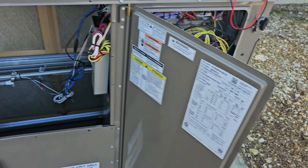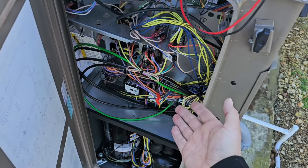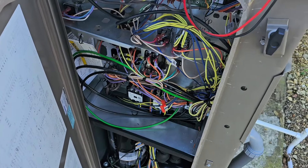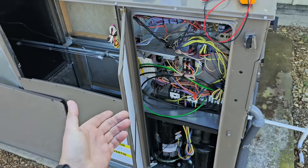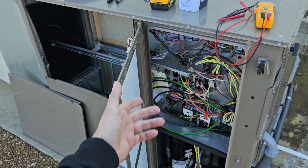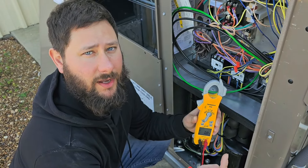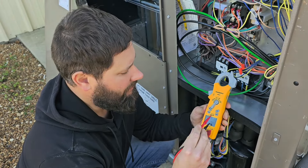If you're thinking, why don't you just find where the 277 is and just hook it up and be done with it? Well, there is no 120 to 277, and I'm going to show you that first and show you how to check it. We're going to use our meter and we're going to check from phase to ground and then from phase to phase to measure the voltage.